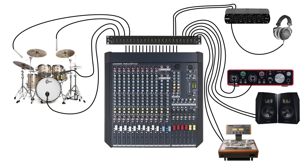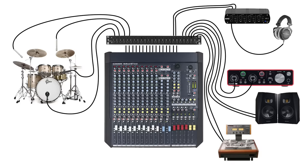Aside from creating headphone mixes, a mixer can be useful anytime you need to route signals to multiple destinations, such as alternate speakers or to a tape machine. A mixer and a patch bay will open the door to incorporating outboard effects like compressors, reverb, and delay. You gain the ability to scale your collection of outboard gear without the need to rewire everything.